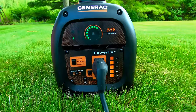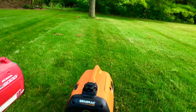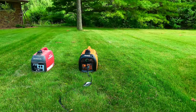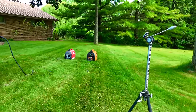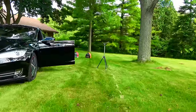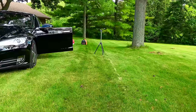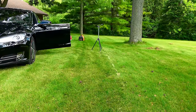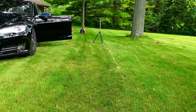Now considering we're using approximately 80% of our generation capacity — that's about 1,600 watts max with 1,440 watts being drawn, only about 160 watts below maximum output — let's hear what the noise level is as we walk away. That's about 10 feet... about 20 feet... and about 40 feet. And considering it's running at near maximum sustained output, it's that quiet. Hopefully you can even hear me talking when standing right next to it.